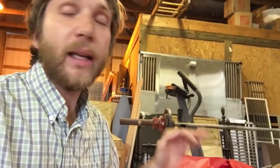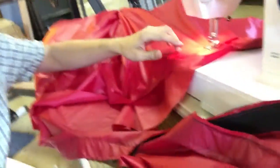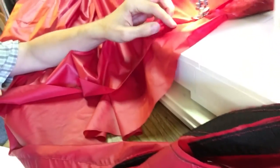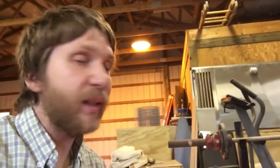The big idea with the sleeping compartment is that it has to be able to open on its own if the boat capsizes — so it can't be sealed all the way around. We're going to seal it with one seam along the back, a really thin strip of Velcro on the front, and then hang weights on it from the side. I've made a mark right where the back seam should go, right behind the edge, and I'll put two rows of stitches in. Then I'll sew in Velcro at the other end and attach some weights to the side.